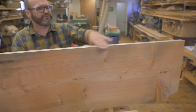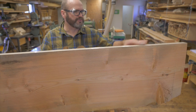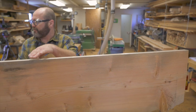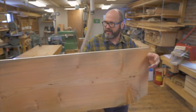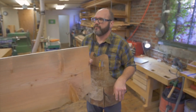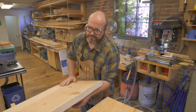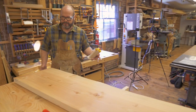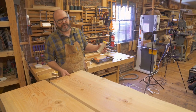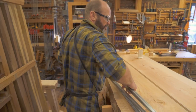Now, if this was a smaller tabletop, I would choose to just smash the two together and distribute the glue, then only put a little bit more on the other one once I've got a fair amount of glue pressed onto it. This glue-up is bigger — it's going to take a little time — so I'm going to be happy with more squeeze out, but it gives me a few more minutes of open clamp time to get this job done.